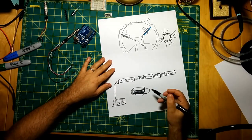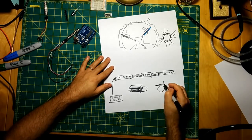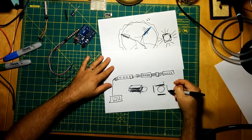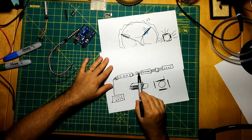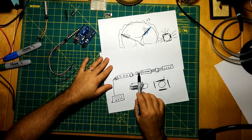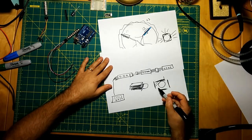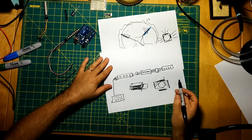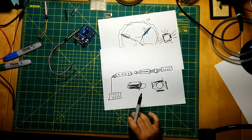So again, in the cross section, you'd have one board on top, one board in the front, one board on the bottom, one board on the side. And then you would have to figure out how to connect them, and I think that's the advantage of having these as a pigtail, is that you can get some kind of extension wire. You can vary the length of these wires to ultimately connect these whatever way made sense on your particular motor, because I don't think there's going to be one configuration that makes sense for every setup.